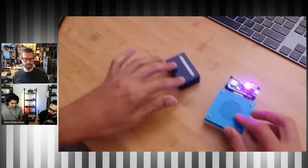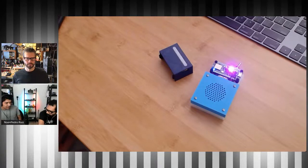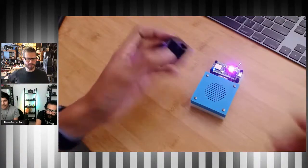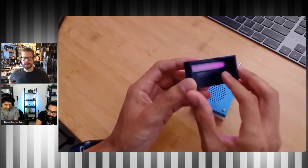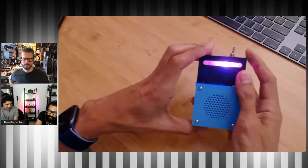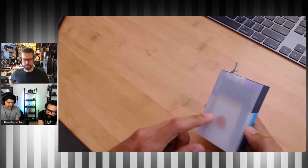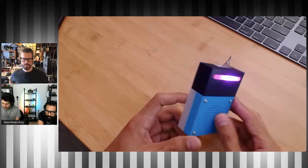It also has some other features, like you can use it as a mindfulness timer. So if you need to get reminded to stand up or do certain things, you can do that. It's a cool little case. I love the light bars. Is that just an inset piece of 3D printed filament? Exactly. It's just a little press fitted bit, and I just have some double sided tape that I stuck in there. But you can pop it out, and it's really good material. That translucent natural clear is what it's called. But yeah, it's PLA. It works really nice for diffusing the NeoPixel. I like it better than using white PLA because this brings out the light saturation a little bit better, like the colors. So yeah, check it out.